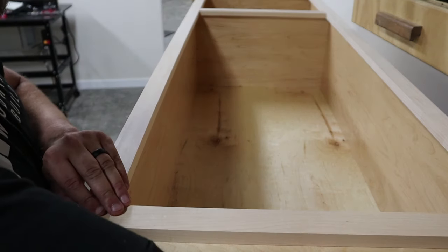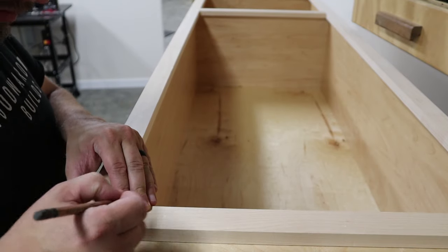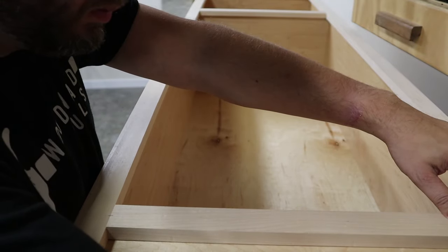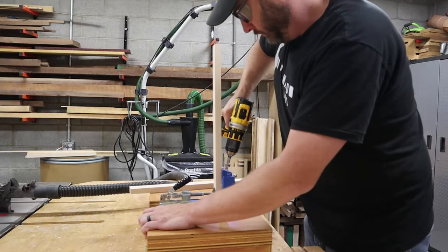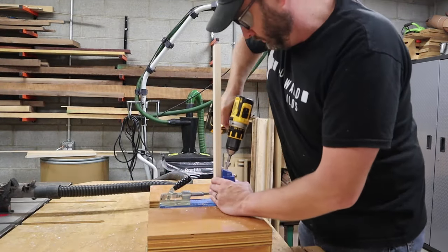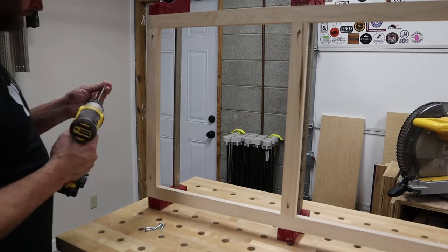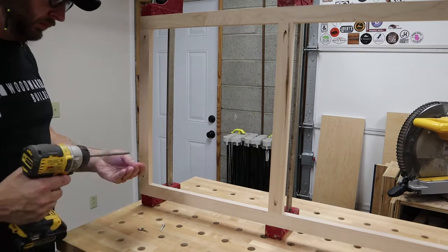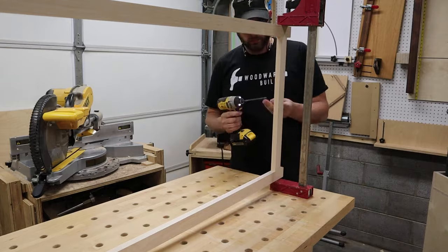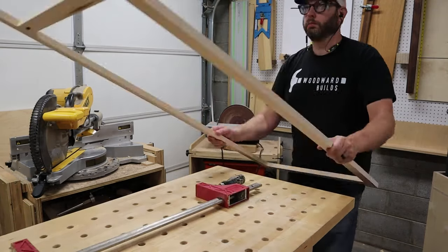The way I like to make face frames is to lay the parts out exactly where I want them on the cabinet, then mark with a line where each joint will line up, and use letters to know which joints line up together. To assemble this, I busted out the old pocket hole jig — I think it's the perfect tool for making face frames because it's quick and easy. I got all my frame parts aligned in clamps to drive all the pocket screws into place. This is where those marks I made on the frame are clutch. Once the screws were in, I could pop off the clamps and my face frame was ready to go.